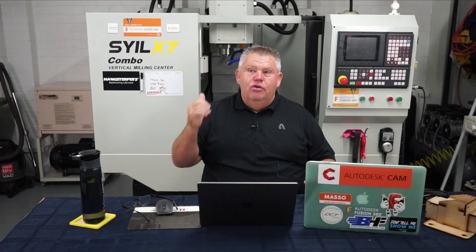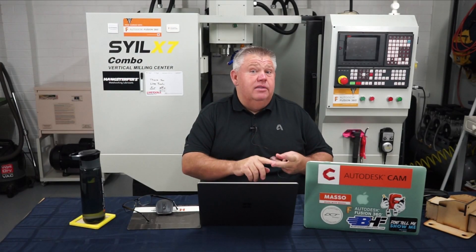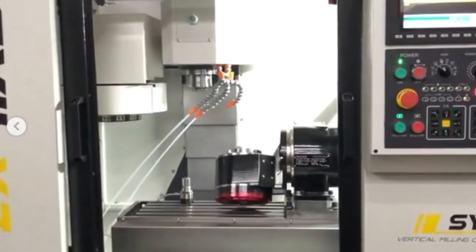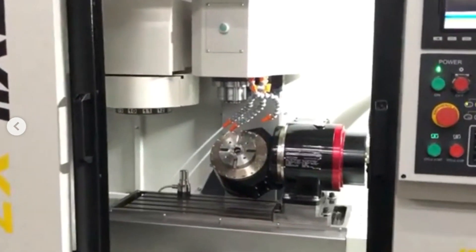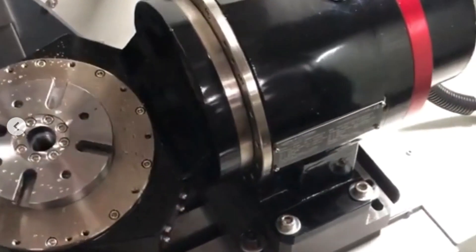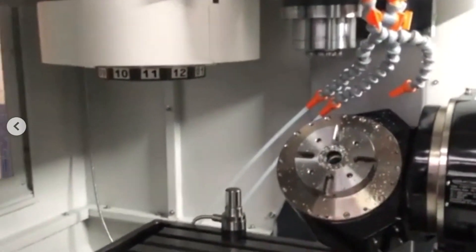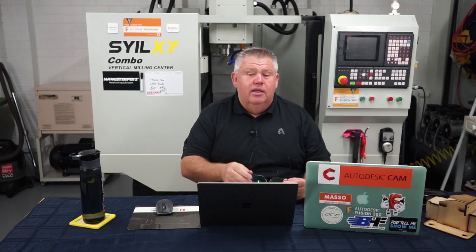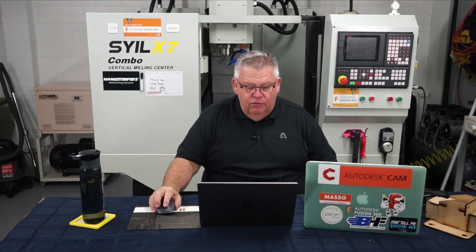Can you grow your machine from three axes to four axes, or maybe even five axes with a trunnion table? It looks like you can. If you get the LNC controller, that's only capable of three and a rotary fourth axis. Same with the Siemens 808D Advanced — it will only do three or four axes. I believe the Syntec 22MA is actually stating it can run four and a fifth axis, which is interesting. Don't take my word for it — if you need more information, contact Sol directly. Mr. Zhu is very active on the forums and will reply to you.